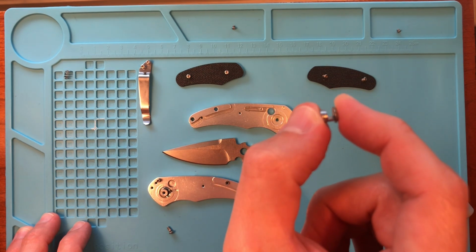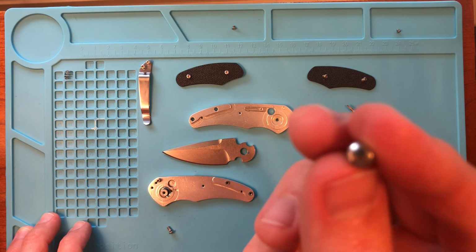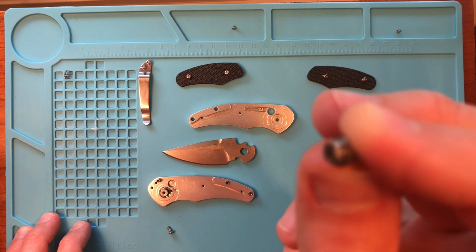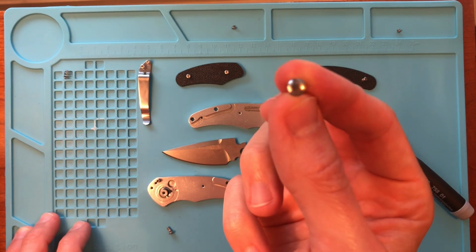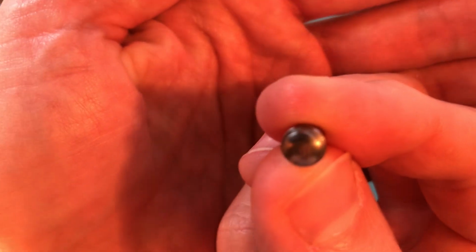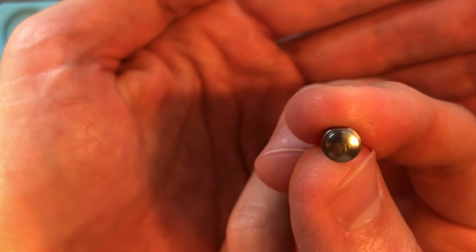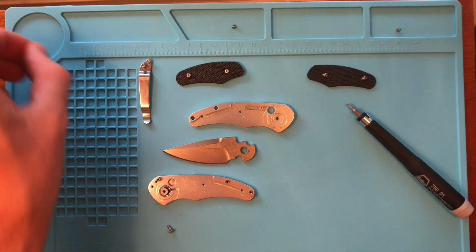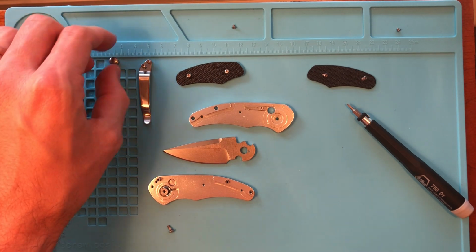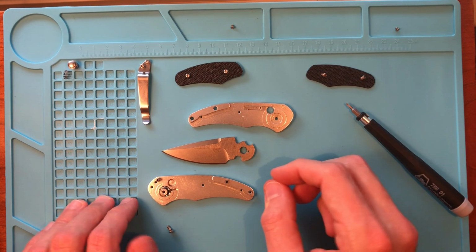It's cut in such a way that's obviously where your blade passes through for the button lock, but there's also a flat spot cut on the top side of this that you need to pay some attention to, because it'll only fit in there one way with that exactly seated. I had a little bit of trouble getting that to seat in there just right on the last disassembly.